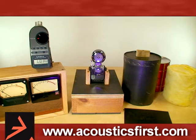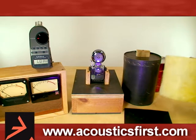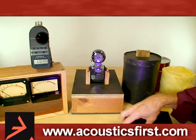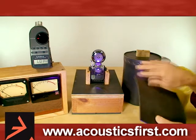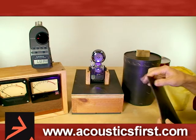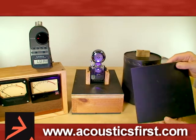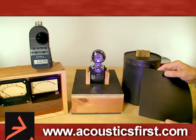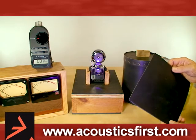In construction or enclosures you have your normal materials like sheetrock, drywall, fiberglass, fluffy stuff. It can be sheet metal or fiberboard, any number of different things. Then you have specialty materials. This is a specialty material — it's Blockade vinyl sound barrier. It's about an eighth of an inch thick, weighs a pound per square foot. You can use this within your wall construction or inside equipment enclosures.